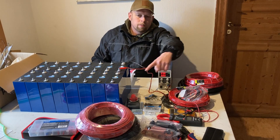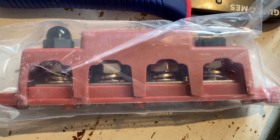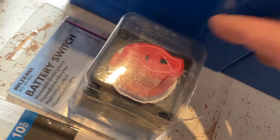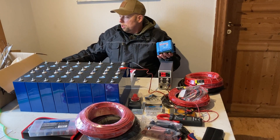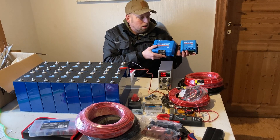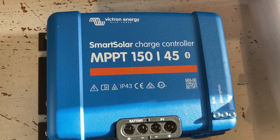Solar cables have just arrived. I also have additional busbars so that devices or battery banks can easily be connected and disconnected separately. Switches rated for the appropriate current are also part of the setup. Two new charge controllers from Victron have arrived — I've decided to only buy Victron from now on. It's expensive, but it should last a long time and it has more or less established itself.